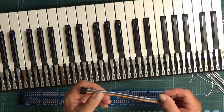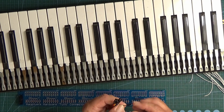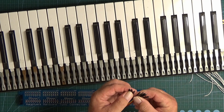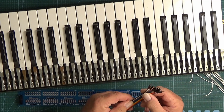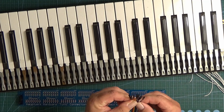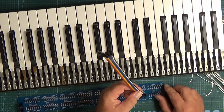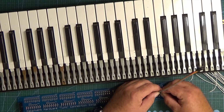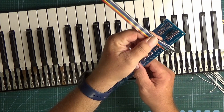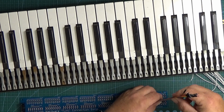But anyway, you can buy these things and they're quite cheap, and what they are is they've got a little socket on one end, and on the other end you can either have another socket or you can have these little pins. So the ends with pins are called male connectors, and the ends with the sockets are called female connectors. And the plan is that these female connectors just push onto these header pins, and they're quite a tight fit, so you can pick the board up with just one of them on there. So you know they're reasonably stable, but obviously they're not as good as solder.